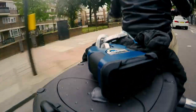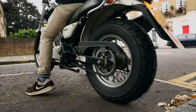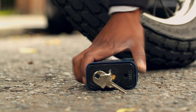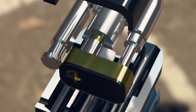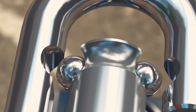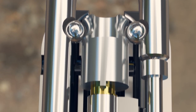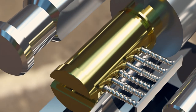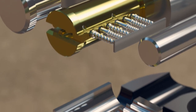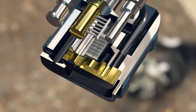The padlock — the tough, clever miniature machine that keeps your bike, gates, and garage secure. What makes this seemingly simple device almost impossible for thieves to break? 41 parts work together, sealed inside two kilos of hardened solid steel. Two precision-cast ball bearings lock the padlock shackle in place, making it impossible to move from the outside. 18 tiny super-strong pins and springs hold the lock shut. Shards of steel form an internal drill-proof armor, and a storm-proof coat completes the resistance of this merciless machine.